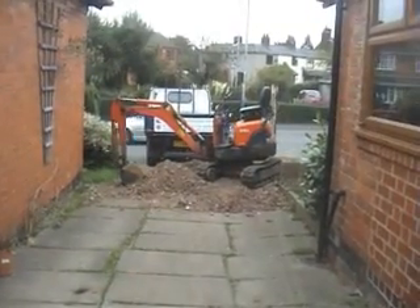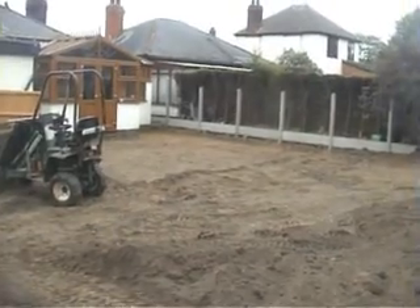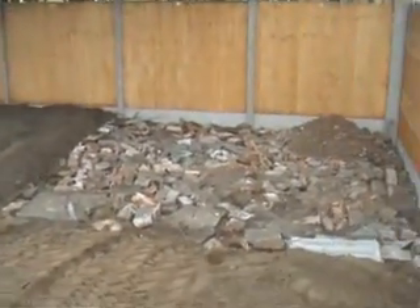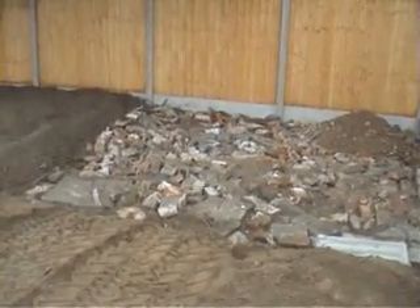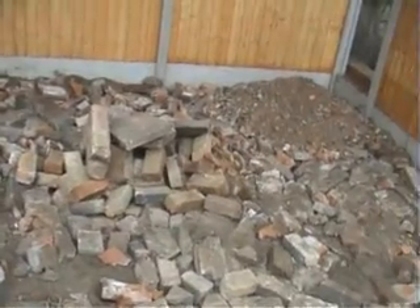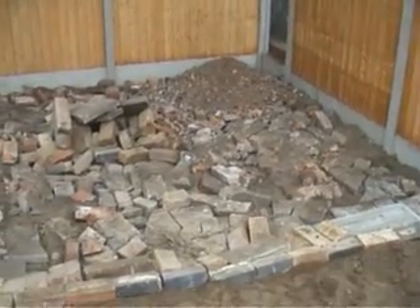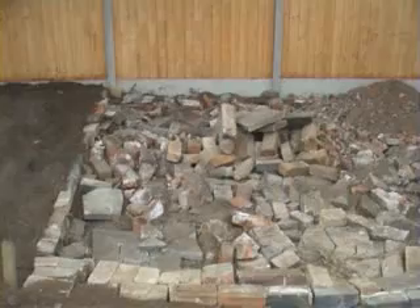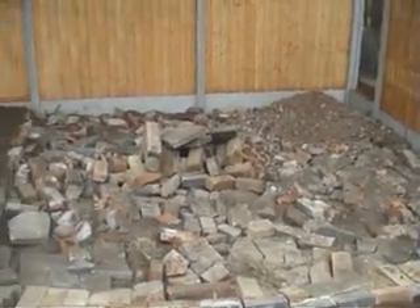I've brought a load of stone from the quarry, tipped it there where the skip was, and now I'm bringing it in. I've taken a lot of soil out of the patio area and put it up here and spread it out a little bit. I've got the final levels to do on it and compaction yet. And this is the base where the garage or shed is going to go — I'm filling that up with the stone I've just brought. The reason I put so much stone in here is that the ground was very low, and if I'd made it up with loose soil and then put the stone on, it would have sunk over later years.